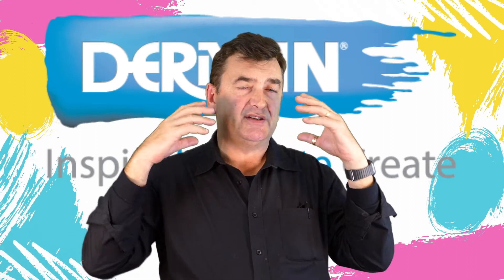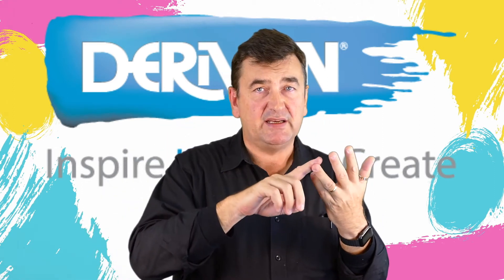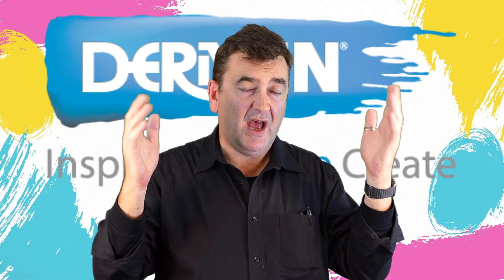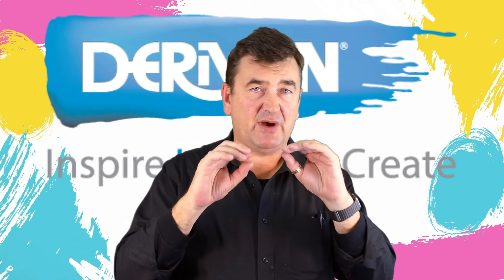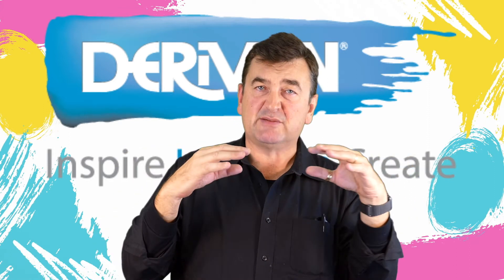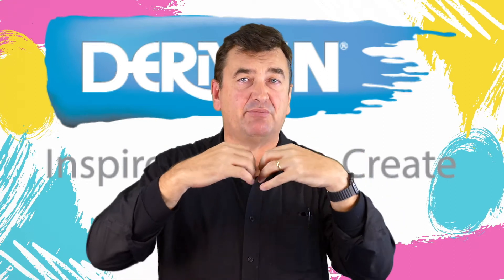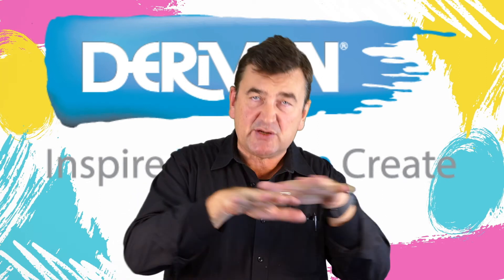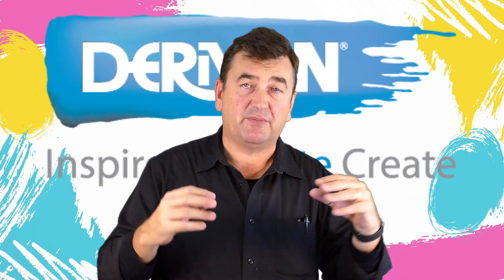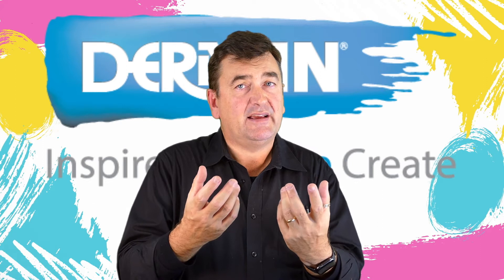When the paint is drying, temperature and humidity will determine how quickly the water evaporates. On a microscopic level, a skin forms across the top where the plastic beads have less water and have pushed together and are touching each other. That's why we see a skin forming across the top — and with that skin formed, there are fewer places for the water underneath to escape.